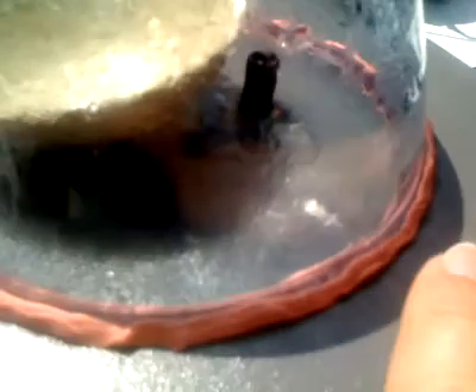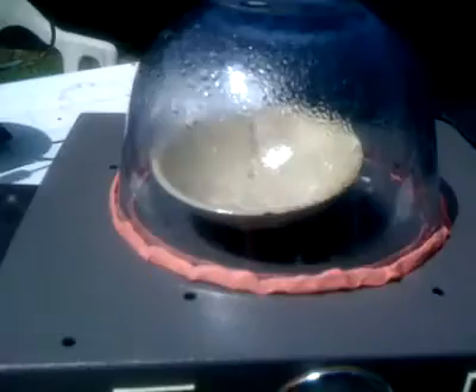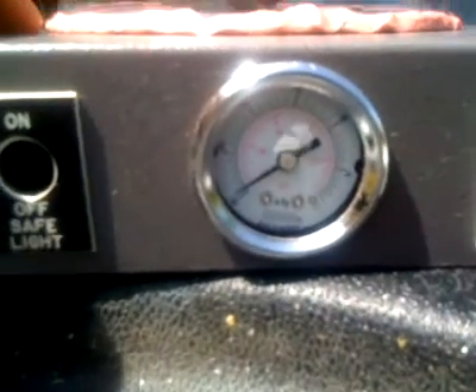There's a lot of condensation in here. What is interesting is that where I've splashed on the metal, I'm getting boiling. I'm thinking that's because in the sun the metal is a little bit warm, and the heat of that is just enough to lift this up to its current boiling point for the given pressure in here. What is a bit puzzling is that I'm not seeing boiling at all in the little bit of liquid in the little dish. Again, you can see the boiling occurring on the metal. I'm pretty sure that's not bubbles of air leaking in, because we're holding about the same vacuum that we were before, and I've pushed the putty in all around the edge here. So I'm pretty sure it's boiling, not air leaking in.